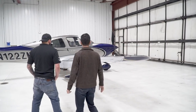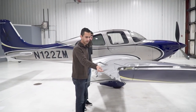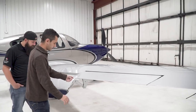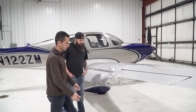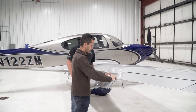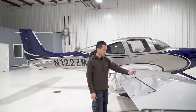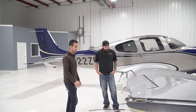As we go back around, these are our control surfaces. These move up and down in flight to control the aircraft. We can already see holograms on here, right? Yeah, we've already walked through and seen them, so we're going to be able to make a big difference on here. This little piece sticking off, however, is like a trim tab. If you hit or move this, it's designed to be bent, so it's not very stout. If we polish on this and push it down, it's going to change how this control surface reacts. So we're going to be very careful with those. There's a strip of tape here, which is there for aerodynamic purposes, also not very stout, so we're going to be careful around those edges.